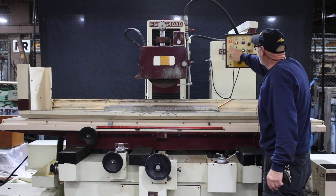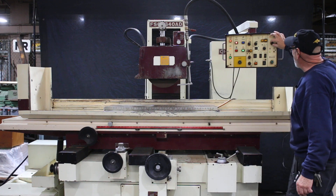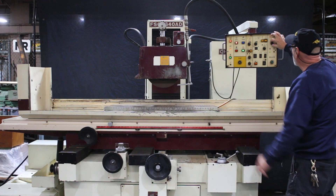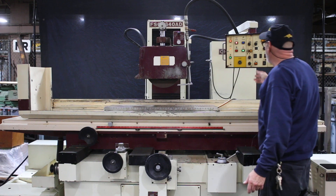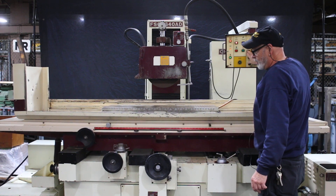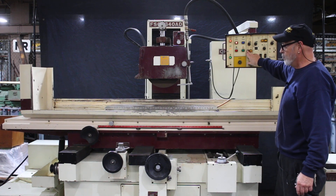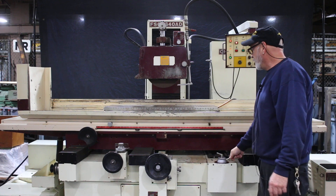You've also got your light for power on and your spindle is running. Over here you have a variable adjustment for your magnetic strength. In the manual mode you've got in and out with your saddle or cross slide. Alright, so we'll start the table again.